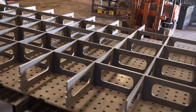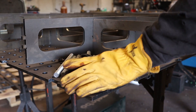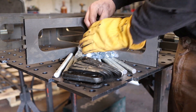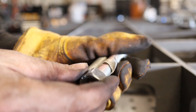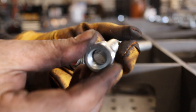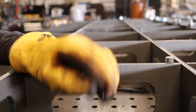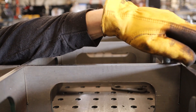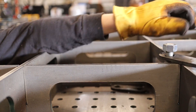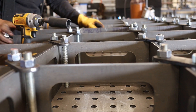This is about what your table should look like — bigger, smaller, same construction. The next thing you want to do is draw all these faces down to each other. To make that smoother, I made these little tabs that we can run all-thread through, and that'll help me draw everything together nice and tight before I even tack anything up. Take two pieces of all-thread cut down to eight inches, four nuts, and one of these plates — you can get them off the website or fabricate them yourself with a drill press and hand tools. You need to draw this entire assembly into itself. Tight iron. No light showing through. Everything needs to be tight because as long as the laser is perfectly accurate and holds a really tight tolerance, drawing all the parts up to that laser cut will hold the same accuracy and tolerance as the laser it was made with.